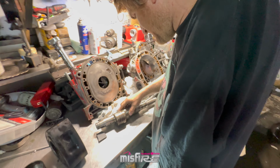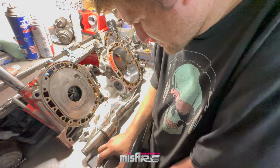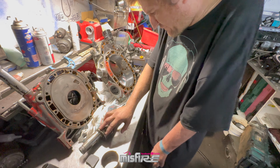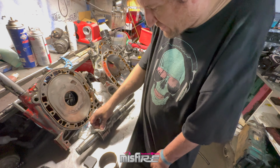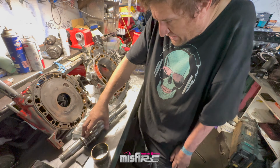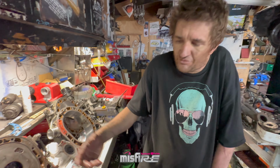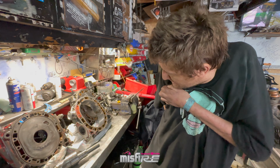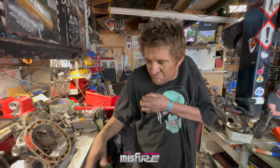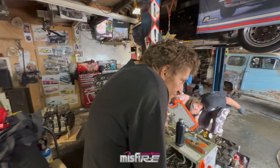So this one, you see where the bearings run on it? All this is on here. That'd be really hard to get off. You won't be able to get that off. And if you get it polished on the lathe, you just never get it properly, it'll be pretty rough. There'll be bearing material right through the shaft and all through the oil system. And all it takes is one of those little flakes of gold that was in the sump to go into one of those little holes, block it up, boom, you lose all pressure. Oh yeah, front of bearing.